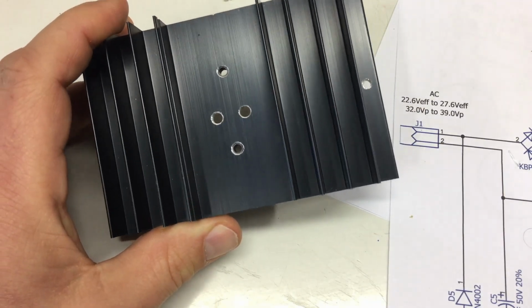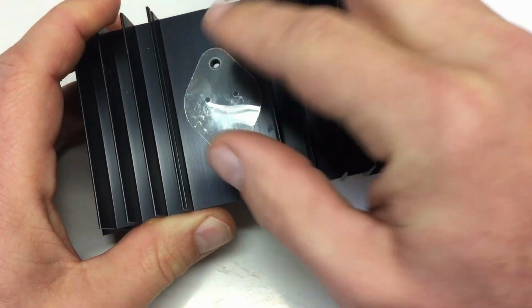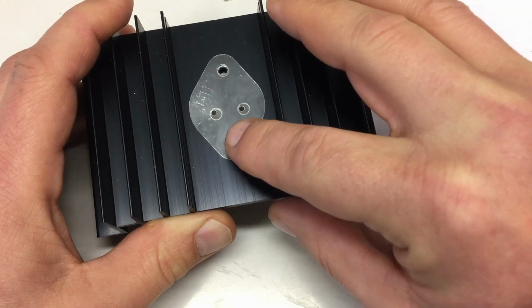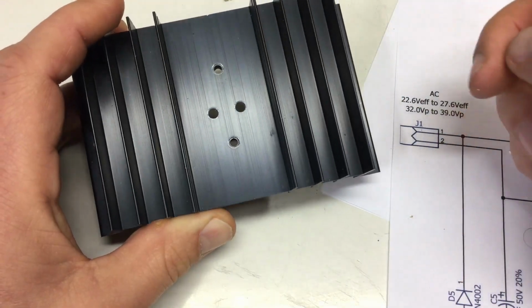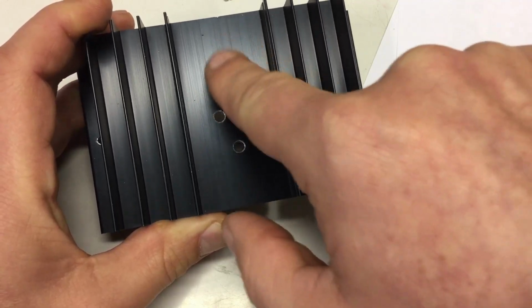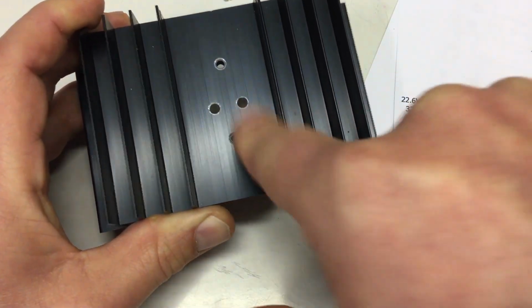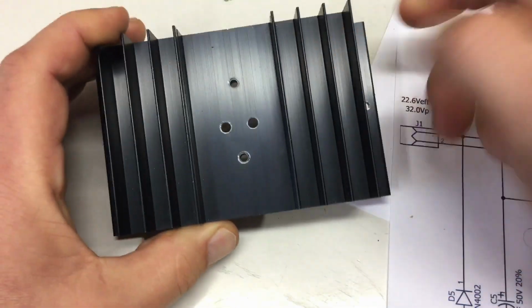If your heatsink doesn't come pre-drilled, you can simply use your mica sheet as a template and mark the spots. Obviously had it that way around. Tape it on, center it, mark the spots, drill the holes, and make sure you chamfer your holes properly, so it's a really nice and flat surface. That's basically all there is to it.